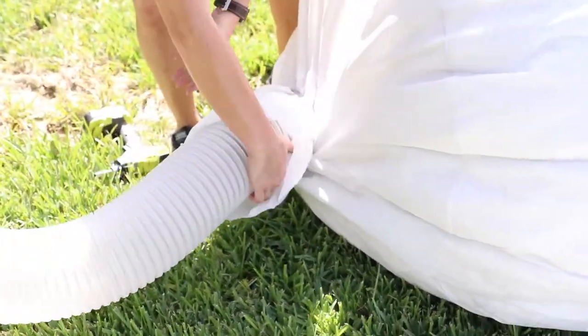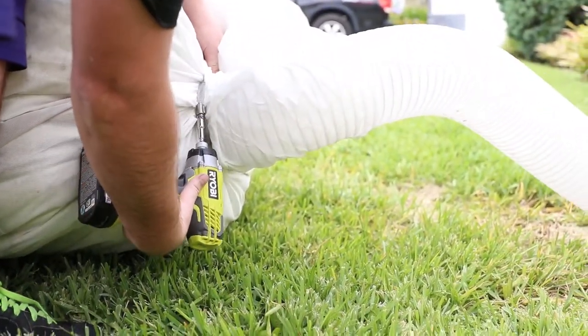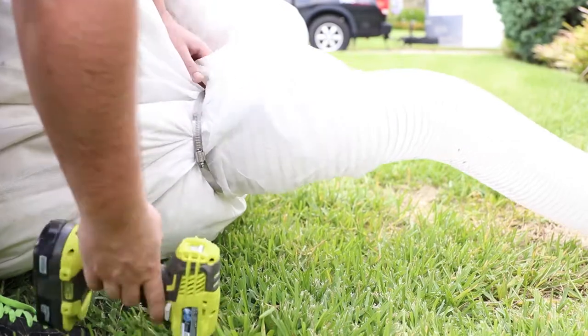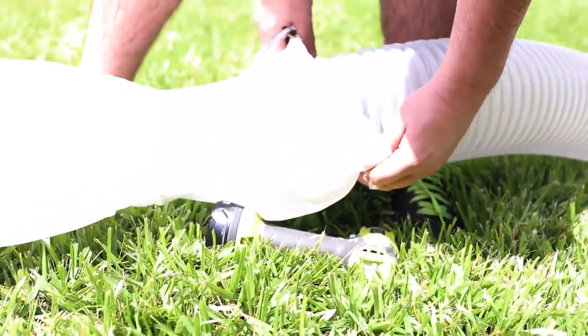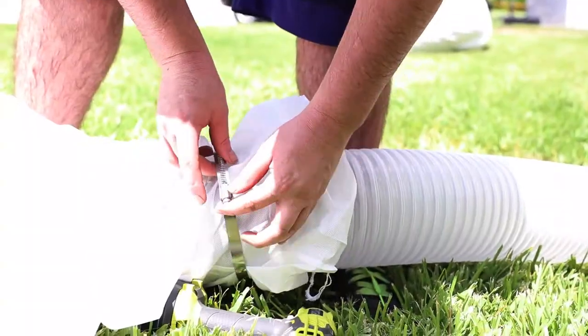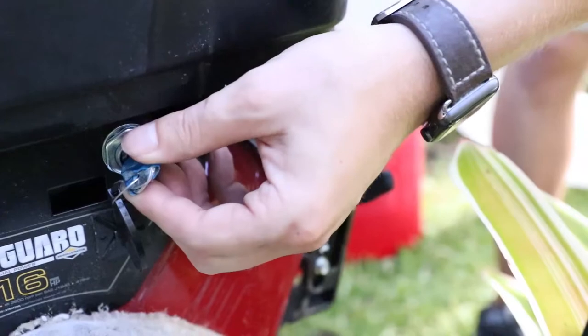Be prepared for the vacuum to stop suddenly. The support will deactivate the vacuum when it's time to switch out the bag. Once the bag in use is almost full, undo and unscrew the clamp with your drill. Pull the hose out, stick it in the new bag, engage, and screw in the clamp. Then start the vacuum back up.